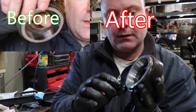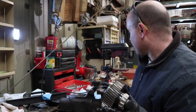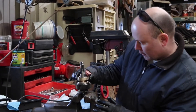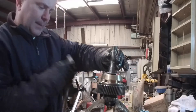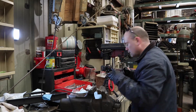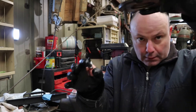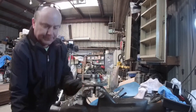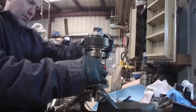I've already lapped this gear. When I first did this, it was a mirror finish — the reverse side was pretty slick, the forward side was absolutely mirror finish. Now it's a little roughed up because it's been lapped already. The cone itself is still held on by this piece, so next we take this out and put the cone aside — that's the gear assembly. This is my output shaft coupling. I'm using some cheap carriage bolts so the shaft coupling can go inside the vise, and now I've got a good strong place to put this on.